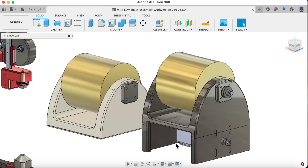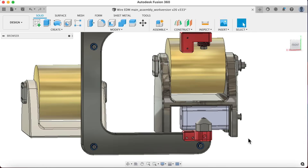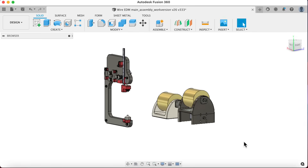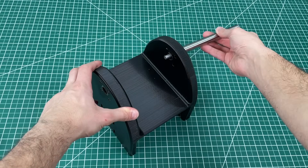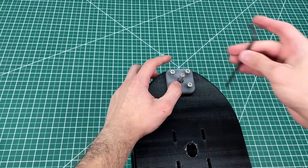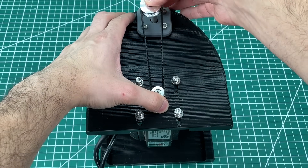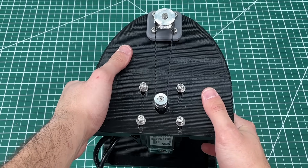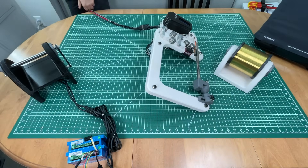Our wire re-spooling mechanism is built the same way as the dispenser but with a stepper motor below which will collect the wire only when the tension drops. By closing the loop with the tension sensor we can ensure very consistent results. We print this component, press the bearings in, install the shaft, and cover it with the cap on one side only. The other side has a custom cap that allows the smaller shaft through, which is where we attach our belt pulley. Note that the stepper motor is mounted in slots where we adjust the belt tension. With the re-spooler all done, let's bring together all the pieces and get ready for our first test cut.